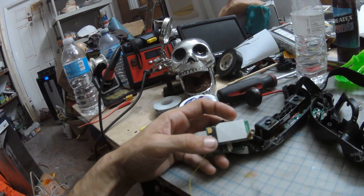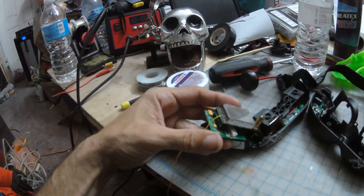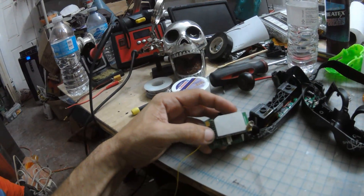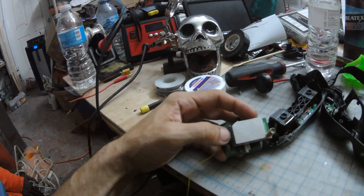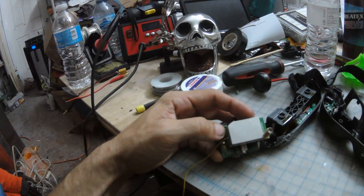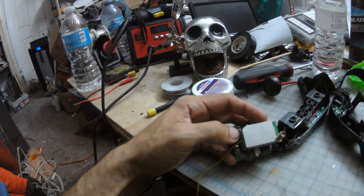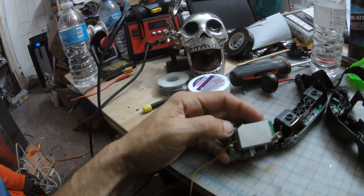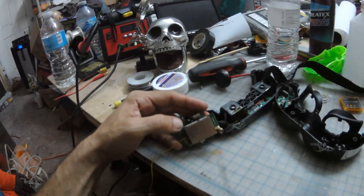So one, two, three, four. The fourth pin from the bottom up is video. Fourth pin from the bottom up is video. And then continuing on forward: one, two, three — the third and the fourth are both grounds. We're going to connect both grounds just because, you know, might as well. And the final one is voltage, so this one should be power. If I mess it up, then there will be no video.